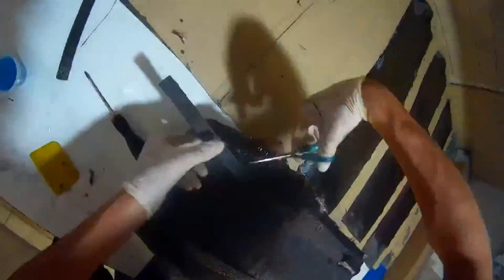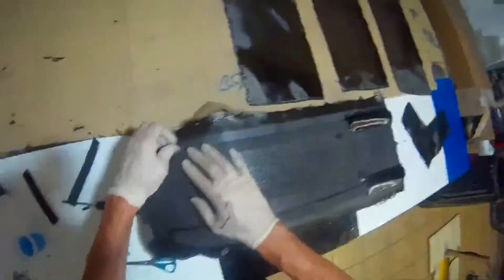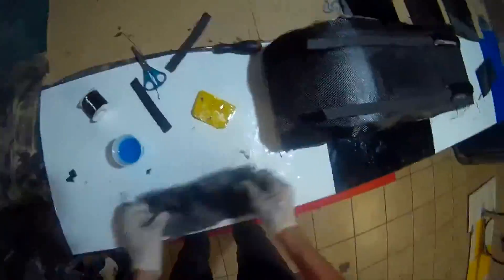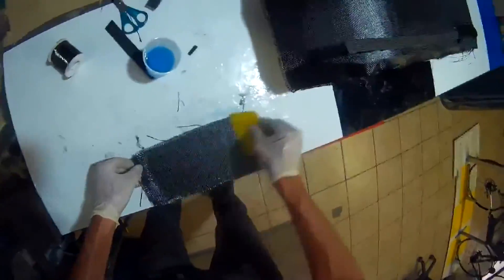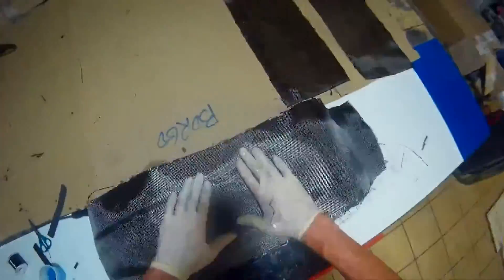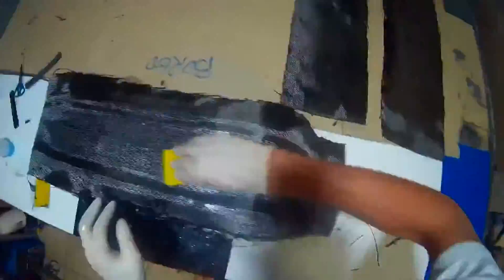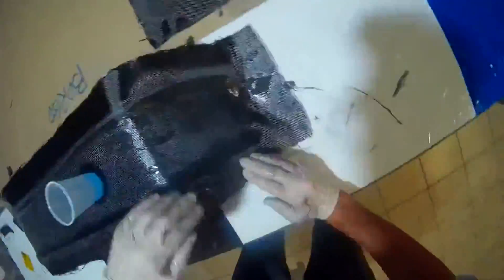They have very high quality carbon fiber and very high quality resin. Then there are other carbon parts on the back of the seat — I put them to hold the ribs in place on the back. They move very easily, so you must work quickly, because at this point all the resin is already applied but not yet hard. You can wait until it is harder, but to make it faster, I place all the ribs even while the resin is not yet hard.